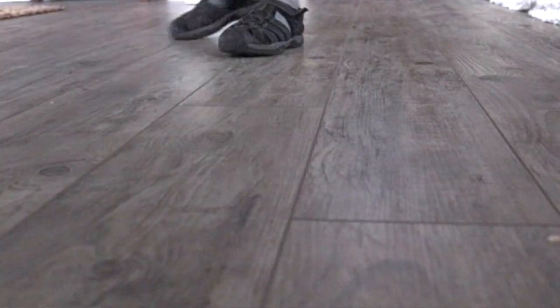In order to repair a floating floor it's much more difficult because the whole thing connects together. So if you have big dogs with claws or young children that you anticipate ruining parts of your floor, consider that when you choose a floating LVP for your home. I wanted glue down LVP so that I could repair my floor myself. That's just my opinion, but I hope that you've learned something from the experiences I shared in this video.